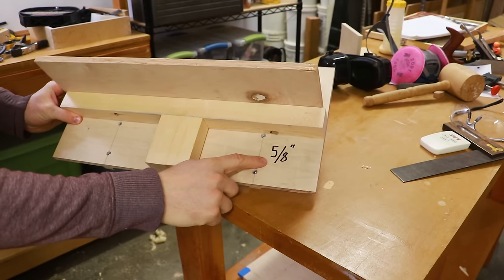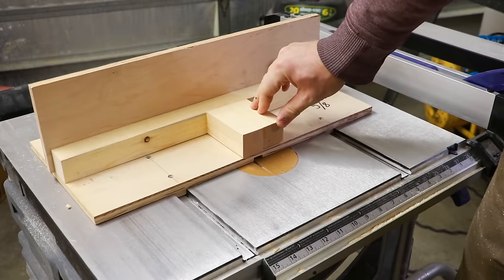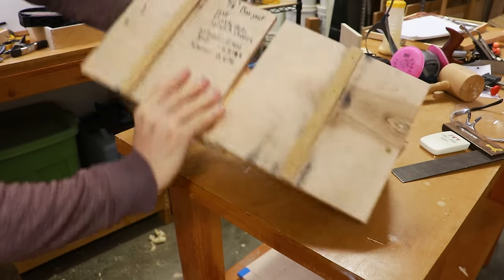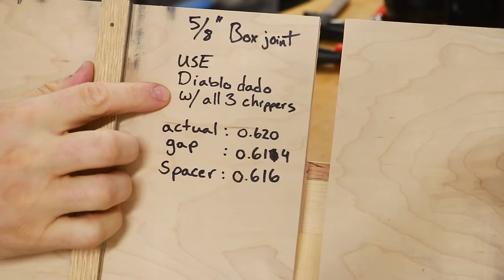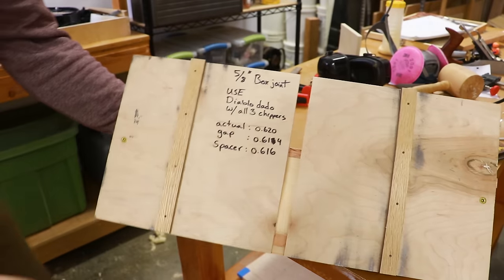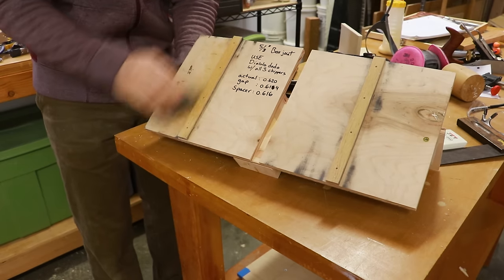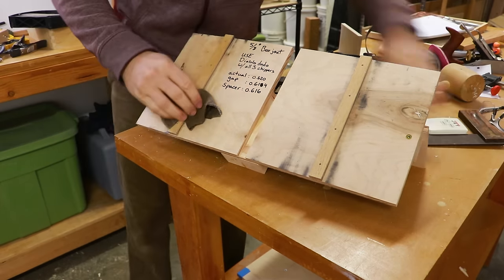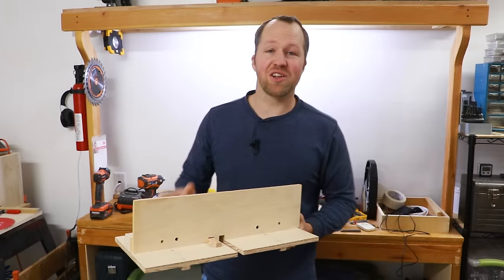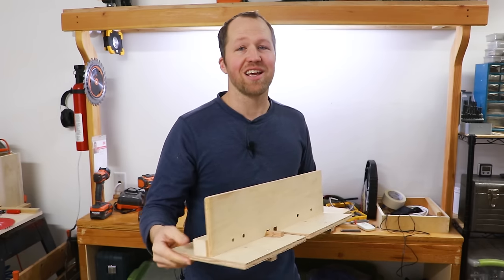I added a little mark for ease of reference for the width of the finger joint, and I made the blade guard wider so that it becomes more difficult to push the blade into that guard area. On the bottom of the board I added more information including the actual blade arrangement to use in case you have multiple dado blades, and the actual specifications on the spacer and gap. The last thing to do is to add some paste wax — this will make the sled glide much smoother over the table saw. Please subscribe to my channel if you found this video useful, consider saving this video to a playlist so you can find it later, and I'll see you guys next time.